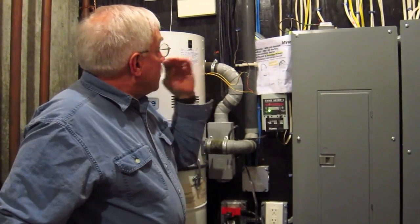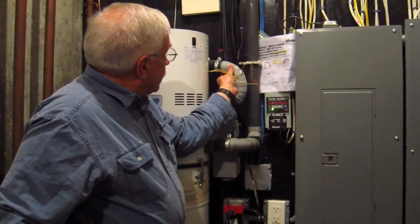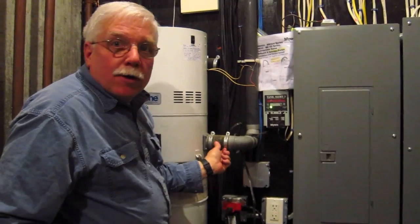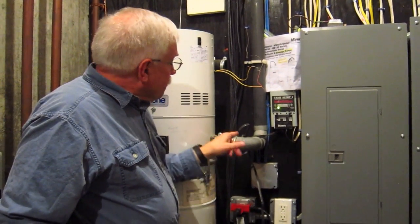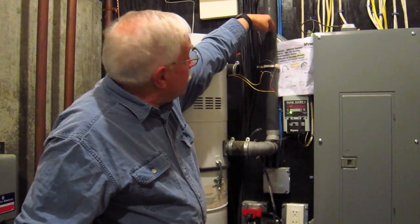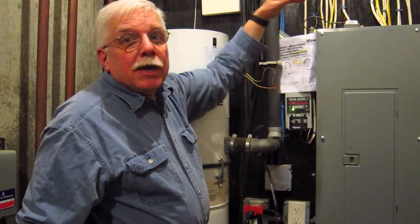What I'm going to have to do is just take these pipes out — it's really pretty simple. There's just a rubber clamp on these machines. Unfortunately, the new unit's inlet pipe is on the other side of the unit, so I'm going to have to cut this pipe up here and reroute it to get the inlet into the machine. But it's PVC pipe — it's easy to cut, it's thin wall, and it's not that hard to do.